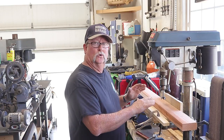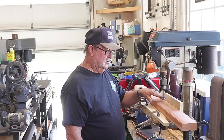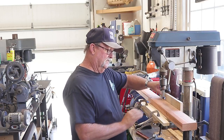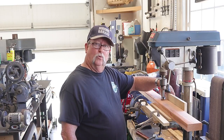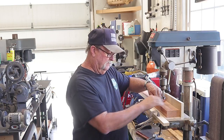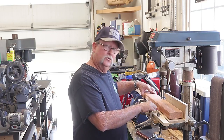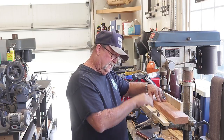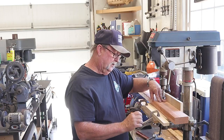I've got 10 holes to drill on each two by four using a 2-and-1/8-inch Forstner bit. My concern is getting tear-out on the back side when drilling through. So I set up a little stop block and a jig from my scrap pile — I butt up against it so every time I drill through I'm flat against fresh plywood underneath. Each hole I slide the board to a fresh section of the backer, so I'm not drilling into an ever-deepening hole, which would increase tear-out. Hopefully this approach reduces the tear-out on the back side.